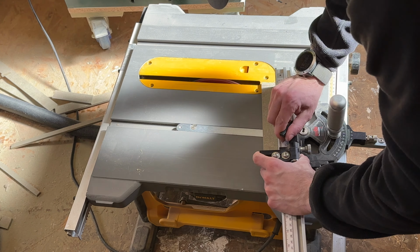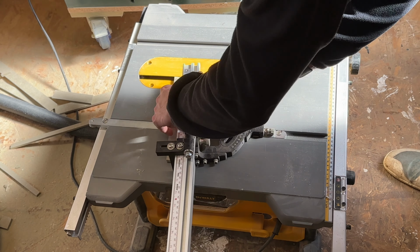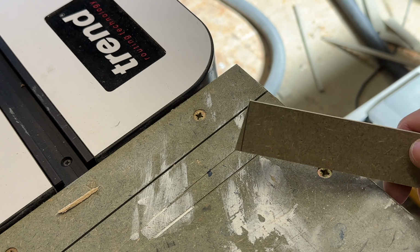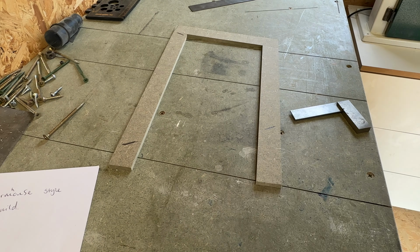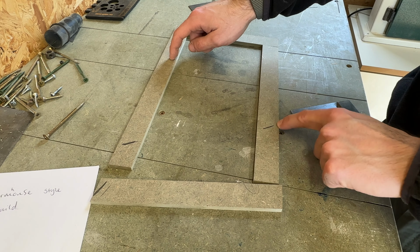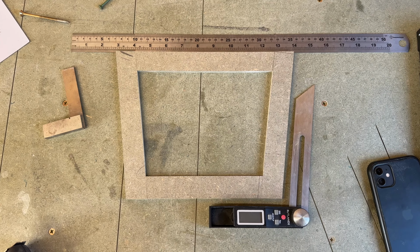Cutting the uprights was long-winded and repetitive, as I had to gradually sneak up on my mark line, removing a little bit more material with each pass, being careful not to take off too much, as that would really ruin my day. Once I had the length locked in using the stop block, it was easy to repeat the cut for the other leg. The process for cutting the top and bottom stretchers was identical and left me with a finished template.